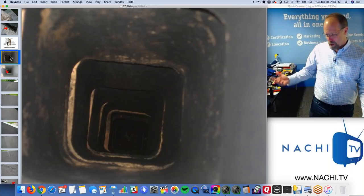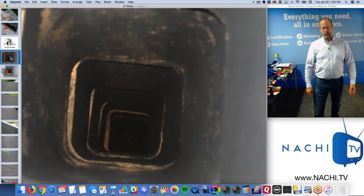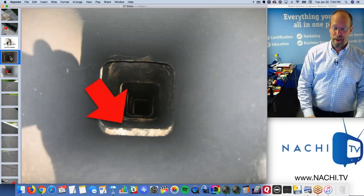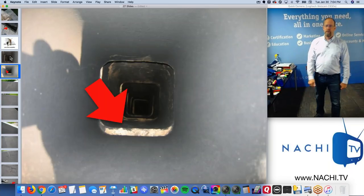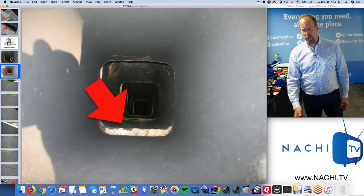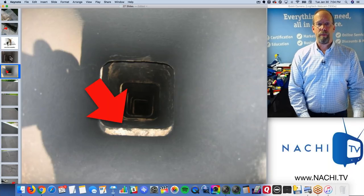You're not required to inspect any kind of flue liner or any interior of any pipe, any underground pipe or flue or chimney or anything like that. However, since I'm there, I might as well take a picture. And when I do, I often find something like that. There's a large separation between the top flue and the other flues, probably the second or third one down. Large hole, right, in the flue. Can't have a hole in the masonry flue liner.